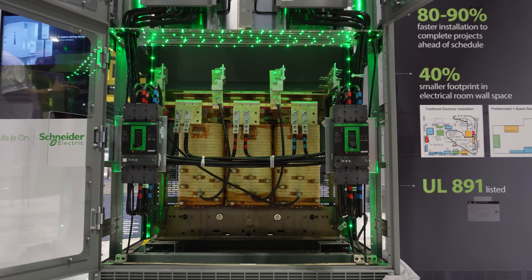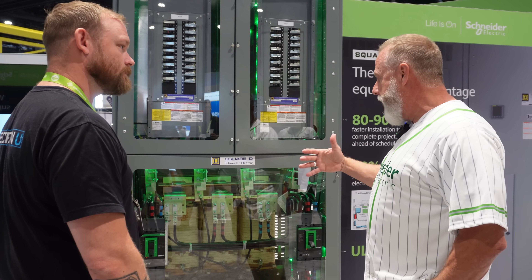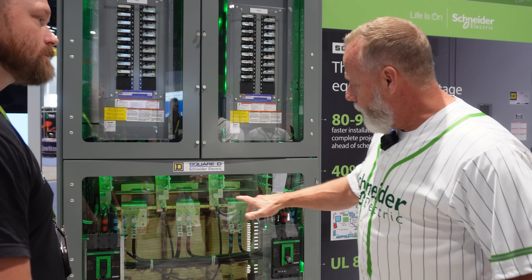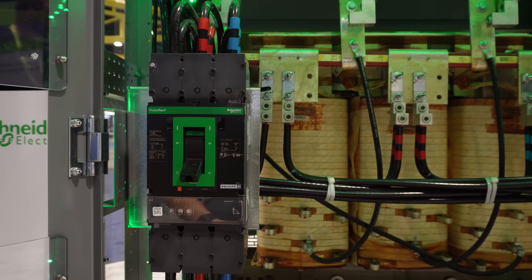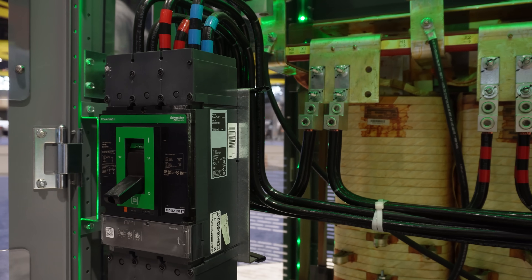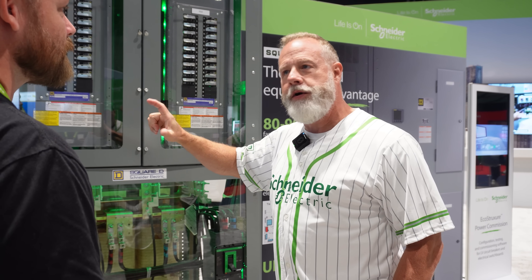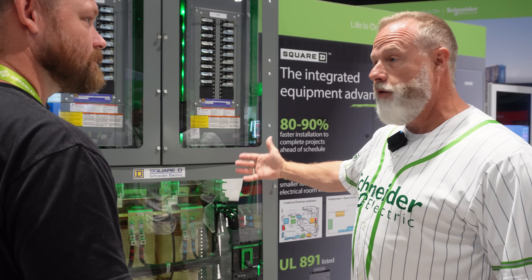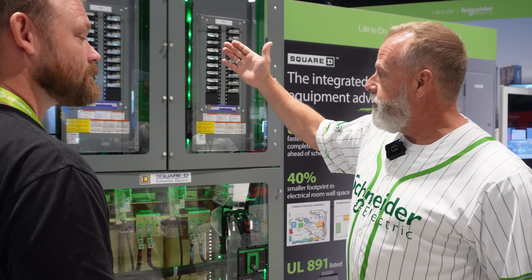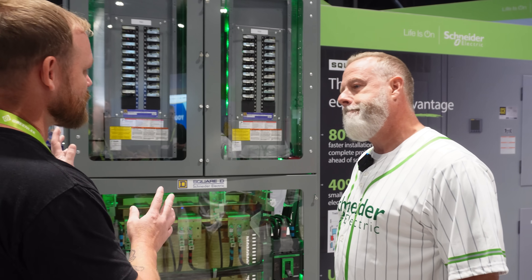A 75 kVA weighs 500 pounds. What you're looking at here is really an EV application, but it's really about transformer and panel integration. You're looking at a low-voltage transformer — 225 kVA in this example — and the breakers mounted in the transformer cell are actually the secondary or main breakers for the panels above. That's all pre-wired from the factory. Imagine this product with two post-60s sitting on a parking deck feeding downstream EV charging applications. But it could easily be just a low-voltage 75 kVA transformer, 480-volt panel, 208-volt panel — all pre-wired from the factory.